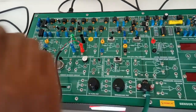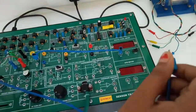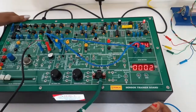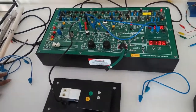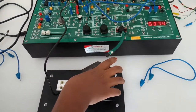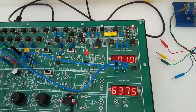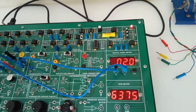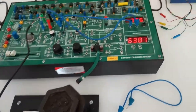Now connect the output at T13 to the DPM meter and connect the ground to the negative terminal of the DPM meter. Turn on the key. With no load applied, the DPM shows zero. Apply one kilogram weight — the DPM also shows one kilogram. Apply another and observe; with a total of 2.5 kg applied, the DPM shows 2.5.